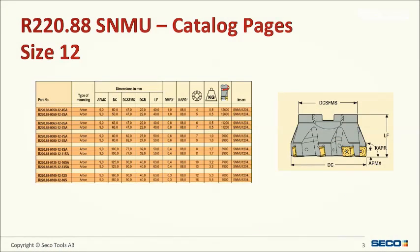With this system we're going to offer two insert sizes: size 12 and size 16. These inserts have two edges — M10 and MD geometry. For the size 12 cutter bodies, we start with diameter 50 and go up to diameter 160, with the corresponding Imperial offering going from 2 inch to 6 inch. Both metric and Imperial will have standard and close pitch versions available.